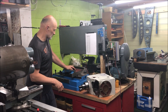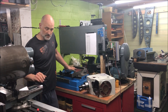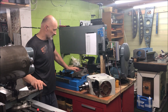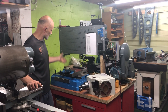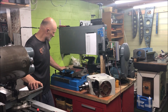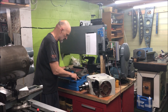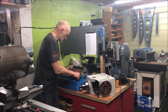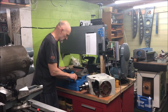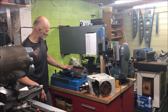My contribution here is to measure up and then probably improve on the fit and finish and alignment issues there may be. In addition to that, which involves scraping of course and the alignment of the surfaces and the column to base. There's supposed to be flaking here — not too bad really, it's at least very finely milled, but the other parts have just been milled, not rough milled, so they could be improved.